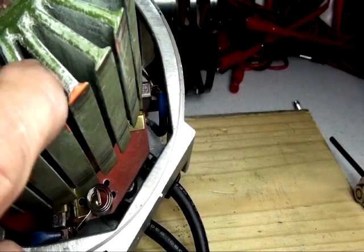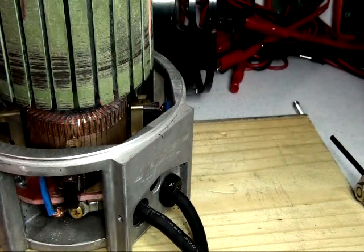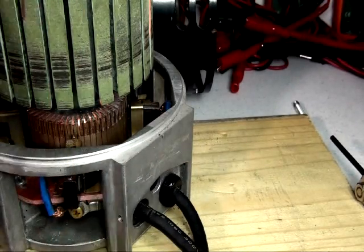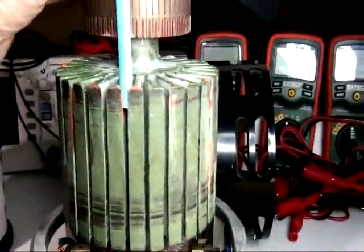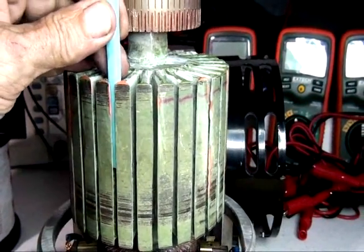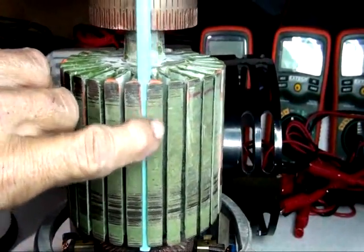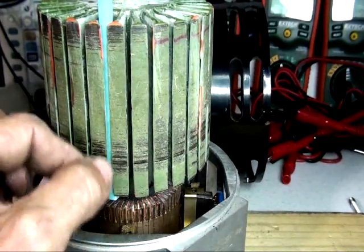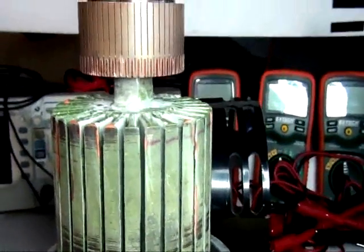Make sure that you run something smooth here, so when we get the wedges in — these are the wedges that are going to be holding the wire — they are supposed to fit in between here. You got to make sure you got it right. They got to fit in between there just to hold the wire in place. You got to slide them in there after the motor is welded and then just touch it up with some resin in between the grooves so it doesn't slide up. I normally grab a very fine needle-nose pliers and start pulling it slowly without taking the insulation from the motor.